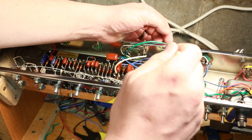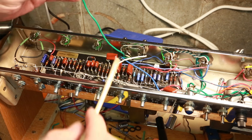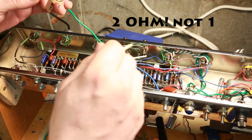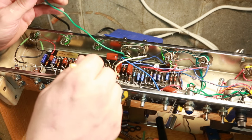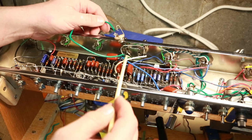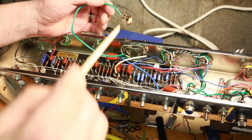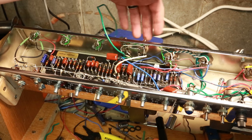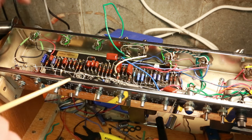There's still access to the trim pot here for bias adjustment. For short-term testing I cut the four-ohm tap and sealed it, wired the one-ohm and the ground across for these guys, and brought the negative feedback back over into where it's supposed to connect. I wired this in temporarily because I'm going to test at eight ohms just to make sure it sounds right with a regular speaker. When I'm done I'll obviously use these RCAs instead.